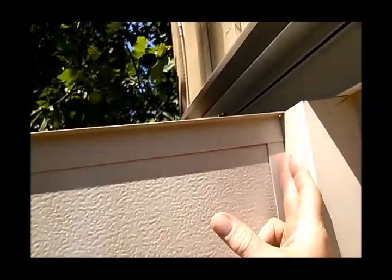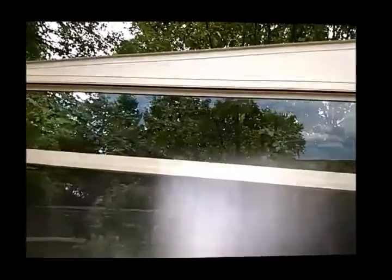The same thing happens at the back. How the panel cap. So that's got a 4.5 degree back cut to match our roof slope. And if you look inside here, hopefully you can see the relief cuts in the U-channel. And now these panel cap legs are going to go nicely right over the top.